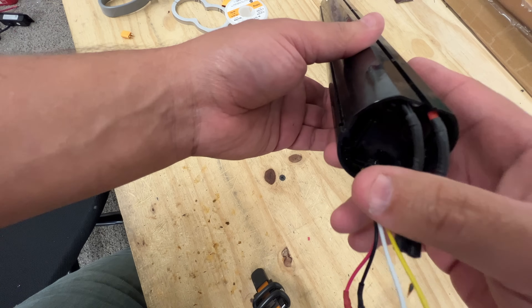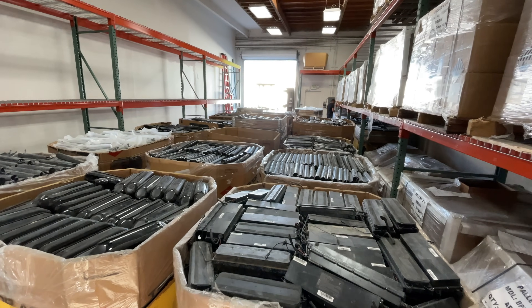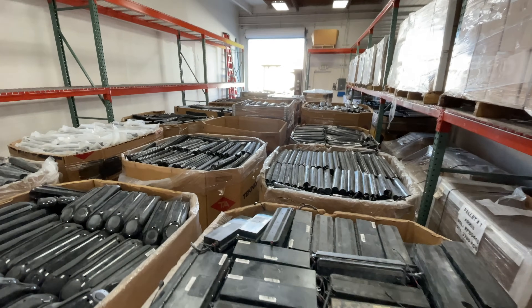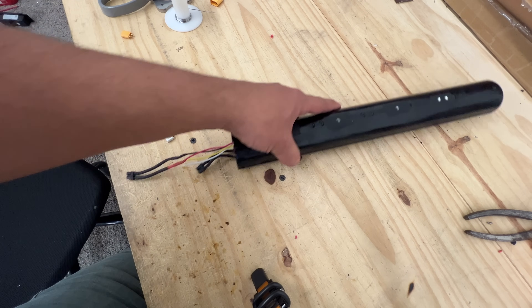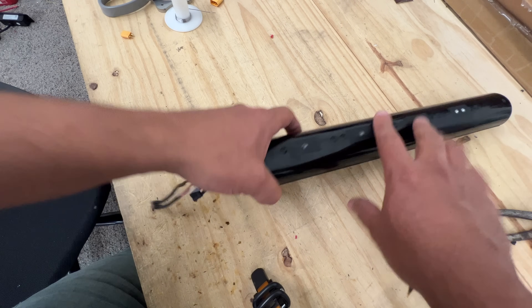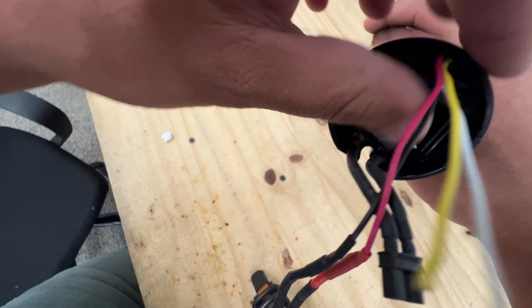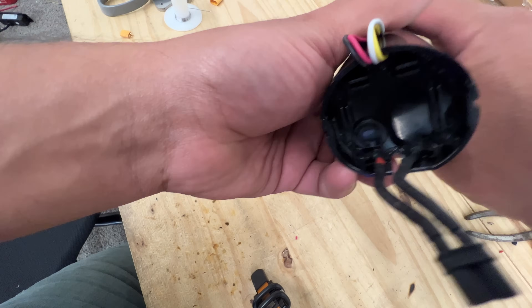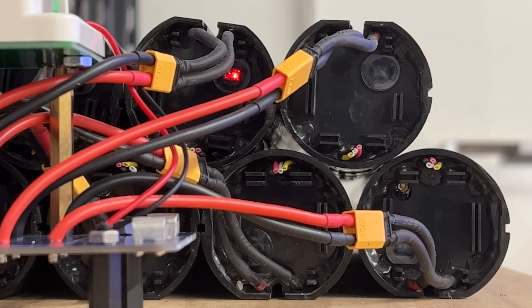The way we have been waking these up — these are dormant because they're discharged. They've been sitting on pallets for a long time, so their state of charge is low. In order to protect the cells from dying, what it does is it turns off the little BMS. It's got a BMS board in here, and when they're on, they have a light that blinks. When the light is not blinking, that means the BMS has turned itself off to protect the cells.